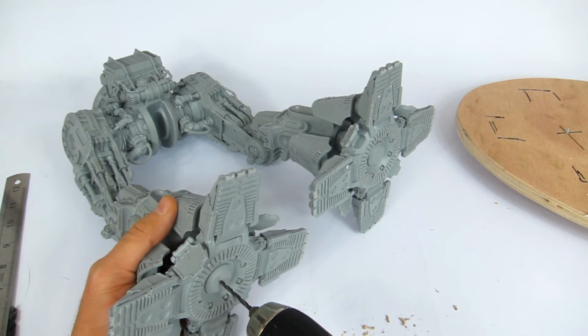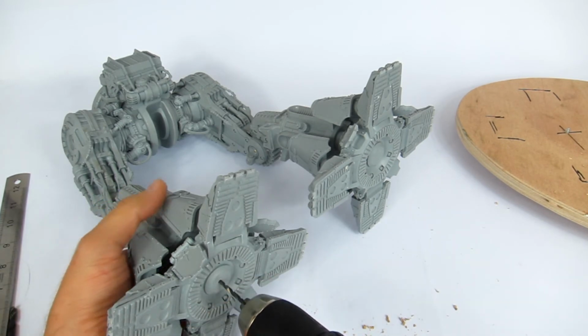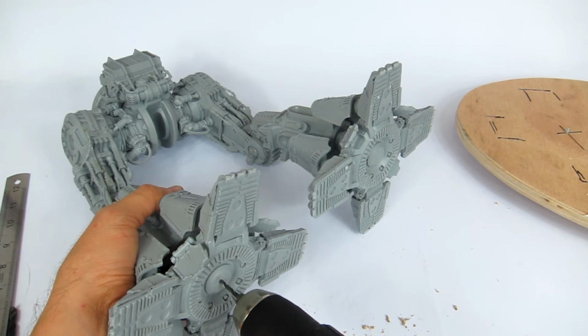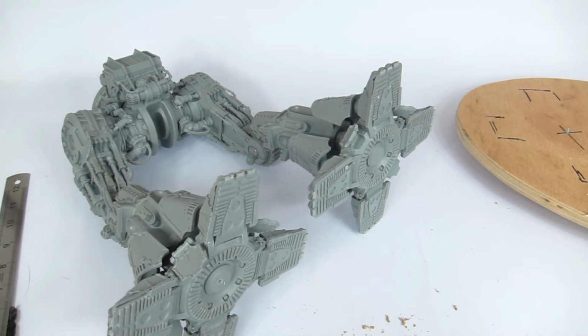We're just going to go through that hole as straight as we can up into the lower leg. Okay, so I felt it sort of thunk into the bottom of the lower leg. And I've gone to that bit of wood that's left in the drill bit there, and I'm just going to get an identical screw, one of the 1.5 inch ones.